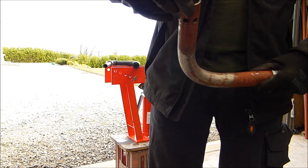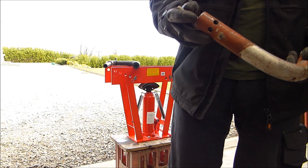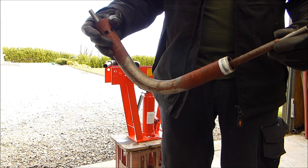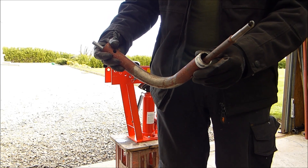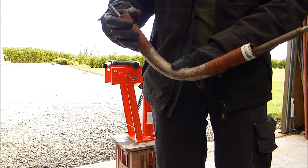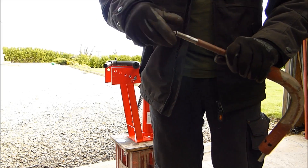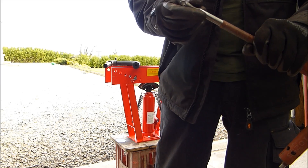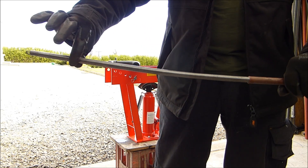10mm holes, 60 degrees apart, and there's six of them - 6 times 60 is 360 degrees. I have copper all the way through as one piece, all the way through that one-inch steel pipe. This end is threaded. I put the bending spring inside the copper so that the copper wouldn't kink. The hydraulic former takes care of the bend on the steel pipe, and it doesn't kink because of the way it's set up. That's why the spring is in there. Just to prove how good it worked out - if it had kinked inside the copper, this spring wouldn't want to come out. The spring wants to come out, no problem.